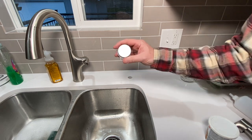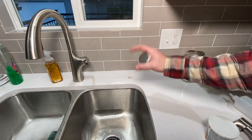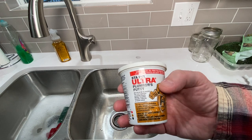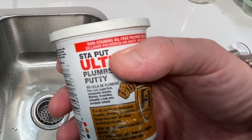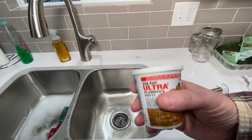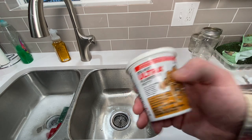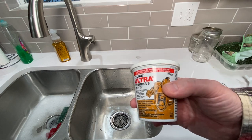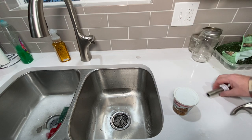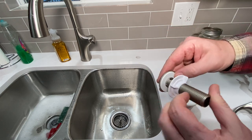So what we're going to do is take a little plumber's putty and stick this cap on. With a stone countertop, you want to use non-staining, oil-free plumber's putty — that is very important for stone, quartz, or marble. If you use regular plumber's putty, it will soak in, turn brown, and you'll never be able to scrub it out.